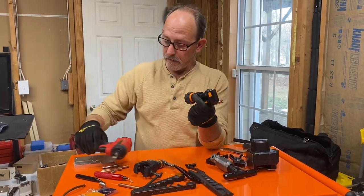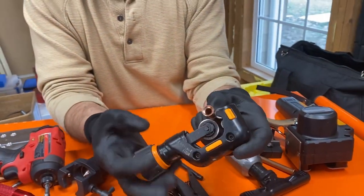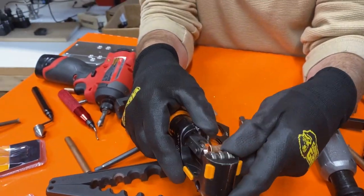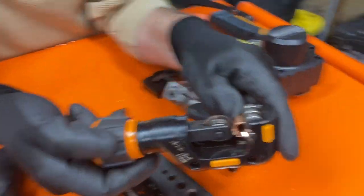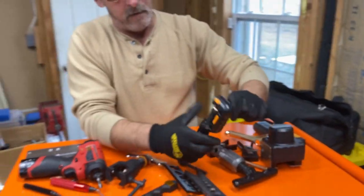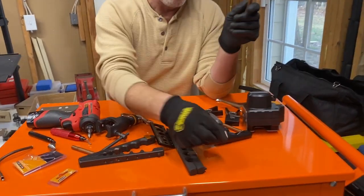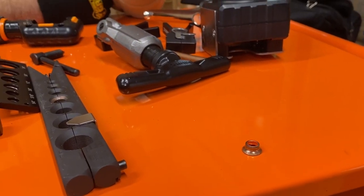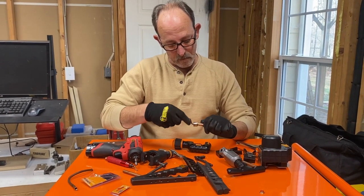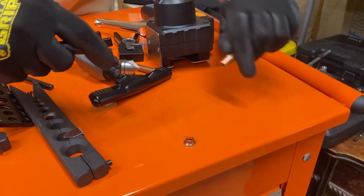Now, I just wanna show you guys, because some of you guys don't realize, I see a lot of guys going all the way out here trying to cut the flare off because they don't realize that these little spaces in between the wheels are actually for your flare, right? So you stick your flare in like that, stick your flare in like that, and you just turn, right? If you do that, that's all you get cut off right there. Right? So, and then we'll go ahead and use this tool right here, this deburring tool. There's a lot of dang shavings come off this. Look at that.